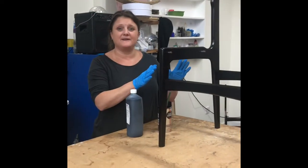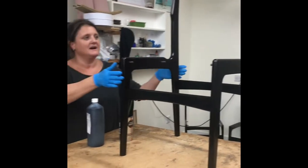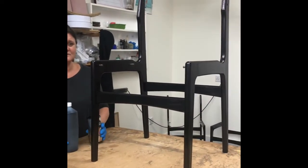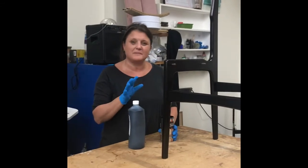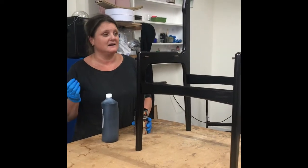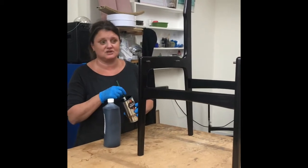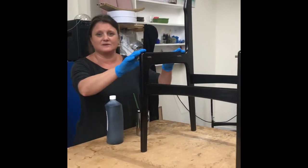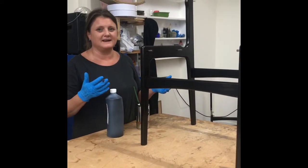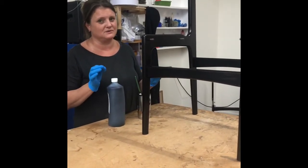Right, okay, that's my first coat all completed, and as you see I had the chair upside down, done underneath, and now I've got it standing up on its four legs correctly. Just to remind you, this is like the European version of Japan black lacquering, using black French polish. I could give it a nice little key down, a little sand in between coats, but I just want to get it done. It's a quick upcycling job, so I'm cutting a few little corners but not too many.